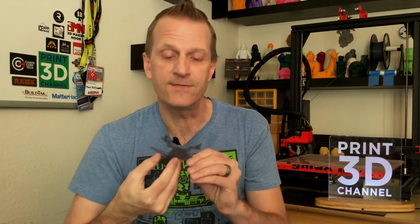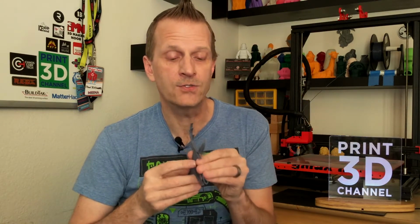The next thing is this very cute reindeer. And I did have to scale this up a little bit in X and Y, not in Z, to 125% to make sure these antlers printed. Because I have a 0.5 millimeter nozzle on my gMax 1.5 XT Plus. And I also played with the settings in Simplify 3D using the single wall extrusion and gap fill and single extrusion infill, just to make sure the antlers printed at the original scale. And they weren't. They were disconnecting a little bit because they're really thin. So I did scale this up a little bit just to get the antlers to print.